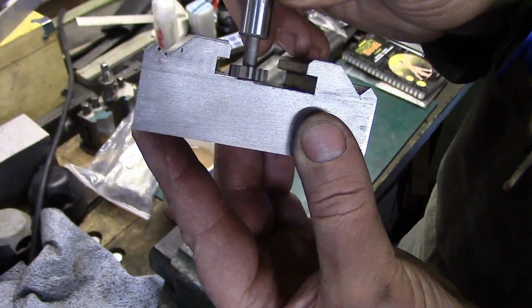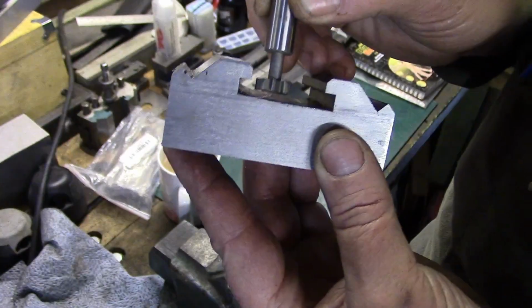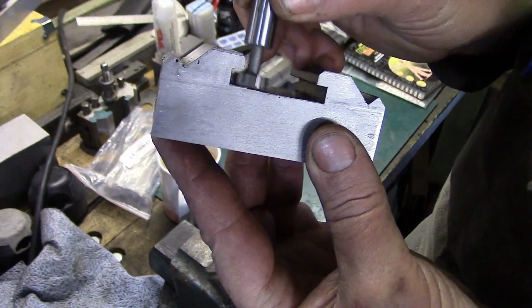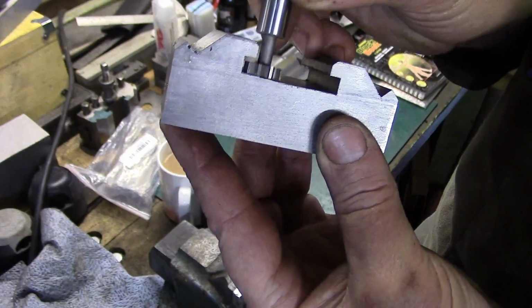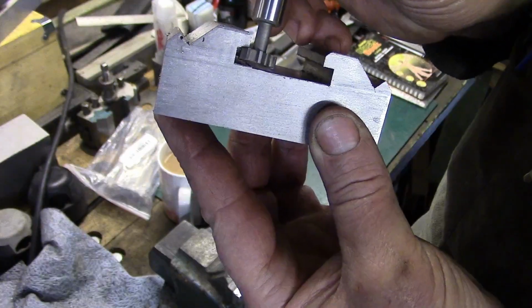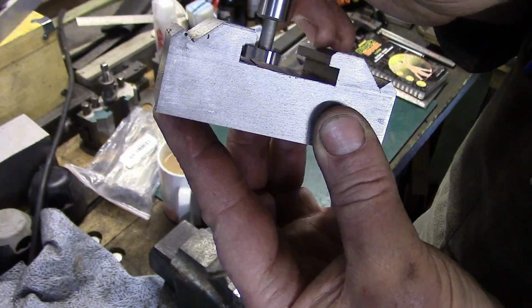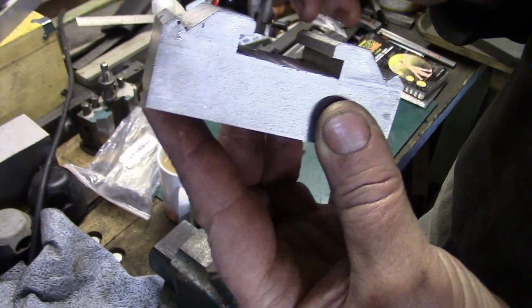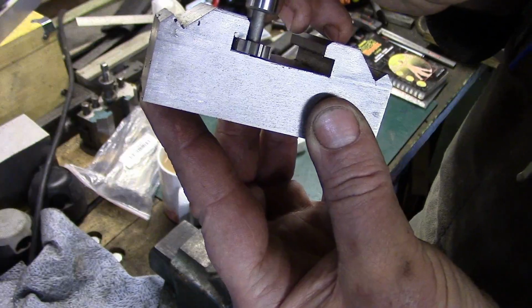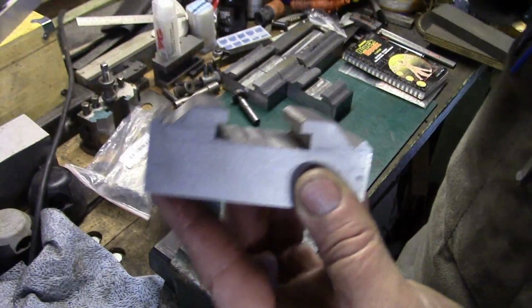Now instead of going in and putting another 40 thou in, I would bring this up. On these tool holders with this particular cutter, I had to come up 93 thou, and that gives me that gap there. So I would come up the 93 thou and then take the 40 thou along the top, and then back this way. Then I'd go into 80 thou, still running along the top, both sides, and then drop back down again, and then take the bottom part to 80 thou. Do you follow my thing? So I'm constantly stepping it. What I found is doing that,